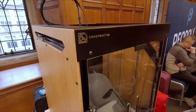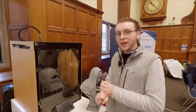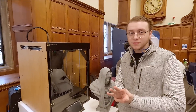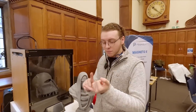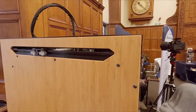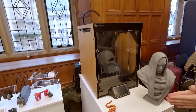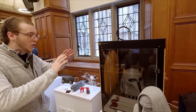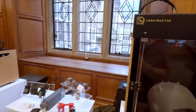MDF is engineering-wise perfect but it doesn't look good — it's not a product. The second best was plywood, so your old Ultimakers and Makerbots made of plywood were actually using one of the best vibration absorption materials possible, but no one's going to buy plywood. The fourth best was real bamboo — not the printer, real bamboo. But if plywood is second best and bamboo is fourth, why not make plywood out of bamboo? This is plywood made of bamboo. You can see on the end grain there are three layers sandwiched and going against each other, giving you the absolute best vibration absorption. And it's not even a wood — it's a grass — so it's really good for the environment, and it looks great.